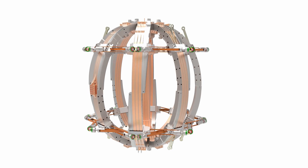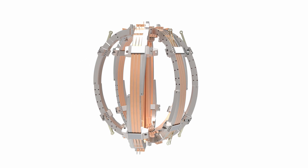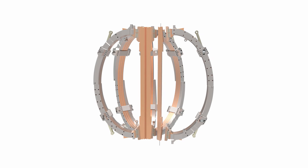As the current goes through these conductors they generate magnetic fields and you get the current in the field and that produces forces. So you get some quite substantial forces generated in the magnet structure on one of the curved outer pieces which we call the TF return limb.